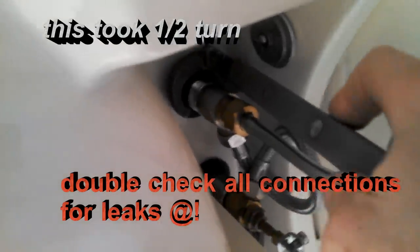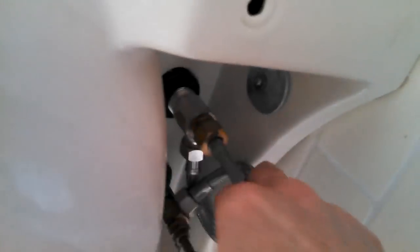I'm up in there and I'm on that nut, and I'm just tightening it that way. I'm going to put the camera down and give it a nice snug tighten. Then we want to check it's not leaking here at the connections, because as you're doing that - or because it was twisting - it could have stressed these connections. If they were leaking, you'd try just tightening them a quarter turn to snug them up and see if they stop leaking. Also make sure the hose isn't kinked; if it is, try to straighten everything out.